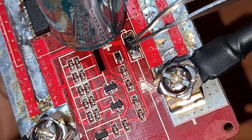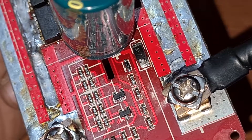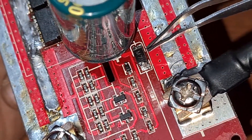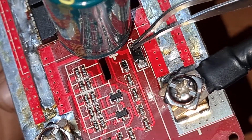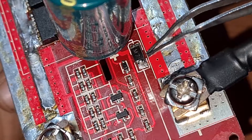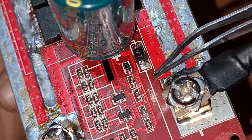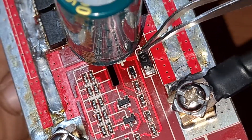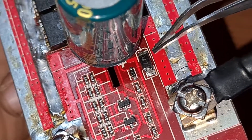Once the diode was replaced, the second thing you can do is add a 10 kilohm resistor in series with the diode. This is to stop the inrush current going into the capacitor, because the capacitor they are using is almost 10,000 microfarad, which is pretty huge. You can move the diode a little further down, connect a 10 kilohm resistor in series, and then feed it into the input of the capacitor.